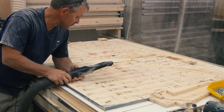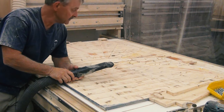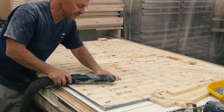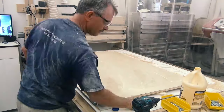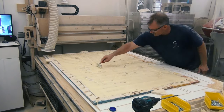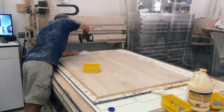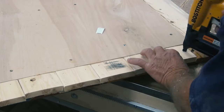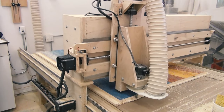To say that was a sawdust maker would be the understatement of the year — no more surfacing anything until I get a boot from my dust collector. But anyhow, this thing is pretty smooth and flat. I glued up a piece of three-quarter inch plywood and left it back just a little bit on the edges so I could replicate the edges to look just like the face. I did this by screwing a long piece and putting little blocks on the edge, then cut the whole thing out to dimension.